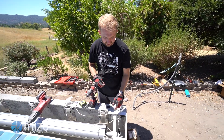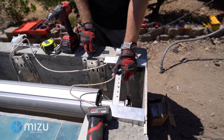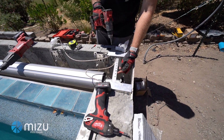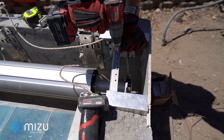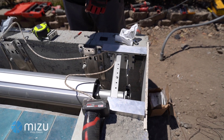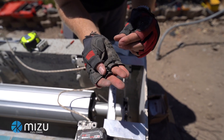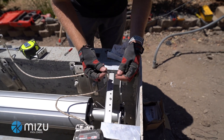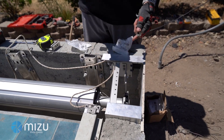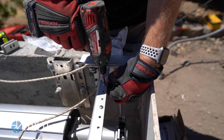Now we have the system mounted on both sides. On the CS3000, the holes on top are where we want to drill — use a 3/16th drill bit and spread them out as much as possible on that bottom arm. In your hardware kit you'll get Phillips head machined screws and 3/8 nuts — two in each arm, so two on this side and four on the motor side. If you're using a drill, be careful: those fine-threaded screws can burn through really quick, so just go slow and steady.